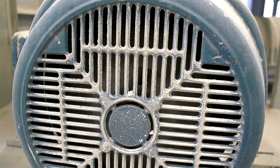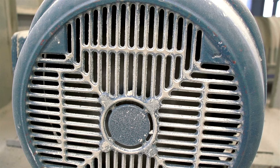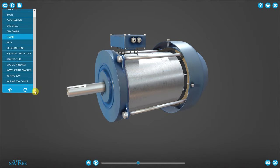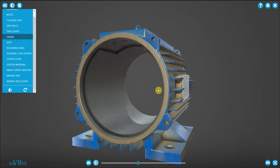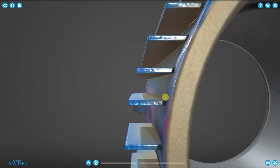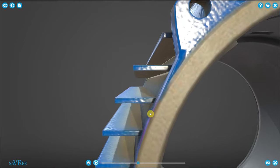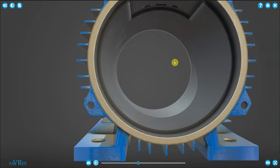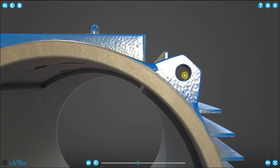If you can provide additional cooling, then the motor can work that little bit harder without overheating. A lot of electrical machines are actually limited in design because they can't get rid of the heat quickly enough. Looking at the frame, you can really see those cooling fins on the side — that's what we use to transfer heat when the motor is in service to the surrounding air.